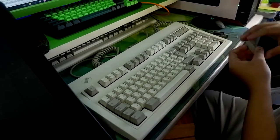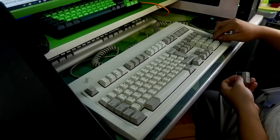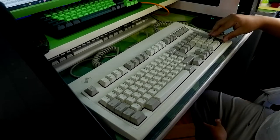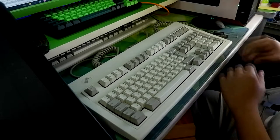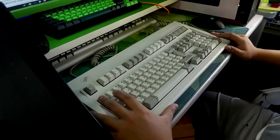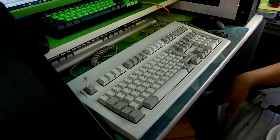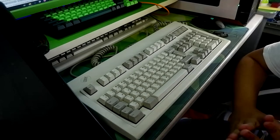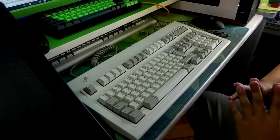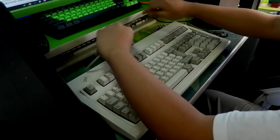It's pretty easy to remove the keycap. They have wire stabs here — interesting, because I know the newer version uses rod stabs; this one uses wire ones. So I'm guessing this is one of the older generations, which is good because I know the older the generation, the better. I was actually hoping for buckling springs. I was planning to buy a Unicomp board, but then I saw the Model M pricing and opted for this because they're way better. Unicomp is also a pretty good alternative — they still sell new ones.